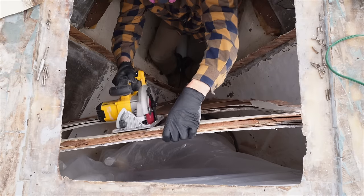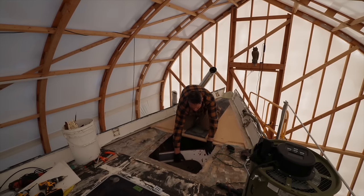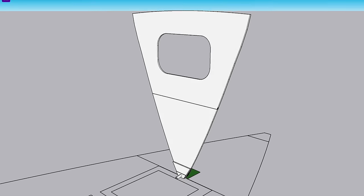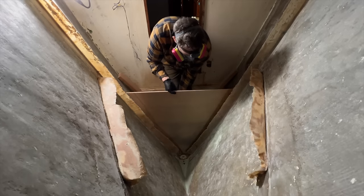If you've been watching this channel for a while, you'll know that the original bulkhead came out as one solid piece of three quarter inch plywood — well, maybe solid's a bit generous because it was completely failed. To get anything back into the boat it's going to have to be made out of smaller pieces to fit through the hatch and the companionway. After talking with Bob Perry and Jim Antrim, we've come up with a design that is four pieces cut horizontally and vertically, giving us a really strong one inch thick bulkhead. We have the lower horizontal section in while I finished the anchor locker, and now we're ready to start putting the upper bulkhead in.